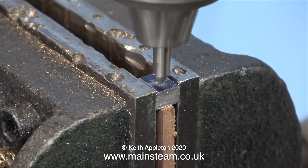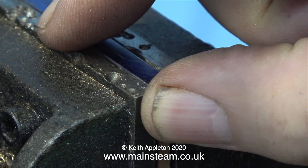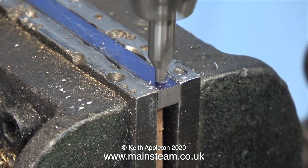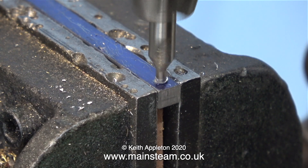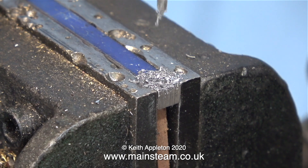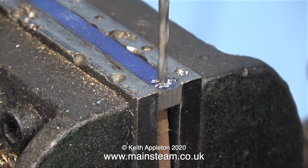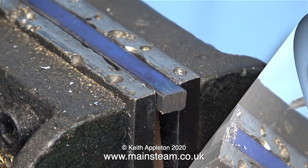How do you find the center? I generally do it by eye or use a ruler, but you can also use things called wigglers or wobblers. If you want more information about these, just Google 'wiggler' or 'wobbler' — they are very simple and at the same time very clever gadgets. I do have a set, but generally I use my eye first because over the years it's calibrated quite well. To any viewers wanting to build a steam engine following these directions, please use the proper measuring equipment.